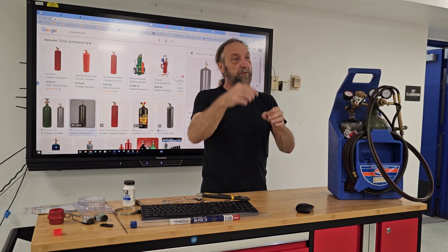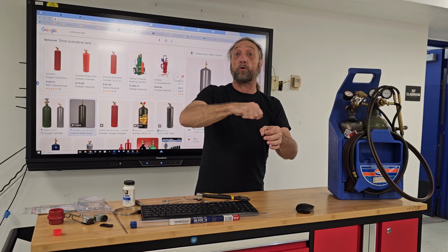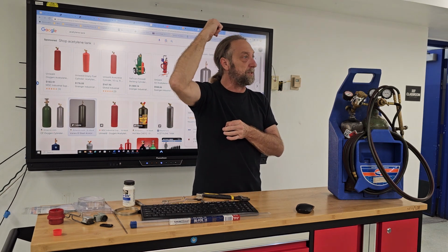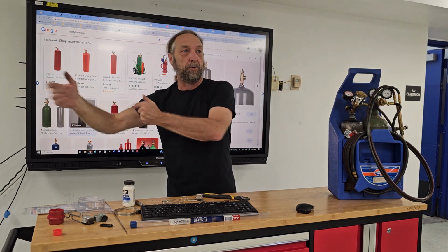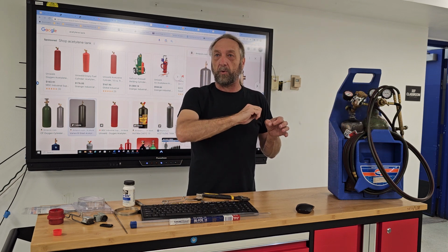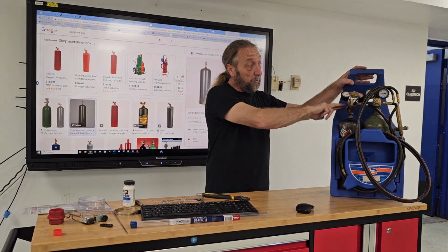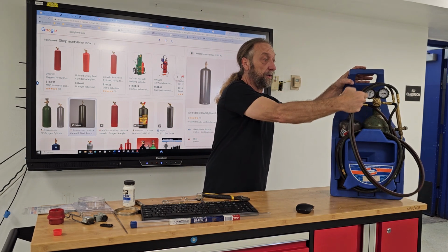Those are like the AC unit you have outside your house where the two lines come in and out. A lot of them have a place for you to close off the outside unit from the inside unit, like if you're doing an evaporator clean out or something like that. You want to trap all the freon outside. We use a wrench to tighten that down, similar to the one we have on top of here. But this one's nice. It came with the dials on there.